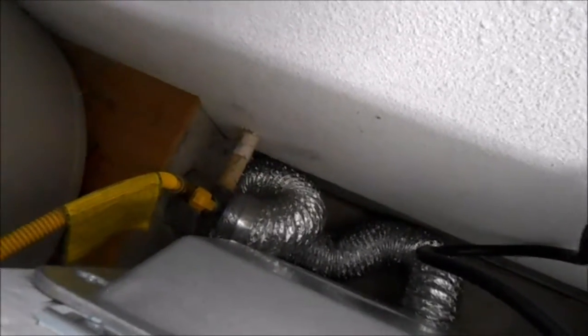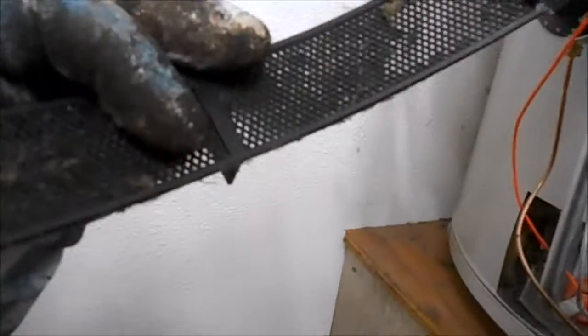We have no fire in the heater here. Quick look down here — that is an excessive vent right there, but it's not my problem. We don't smell any gas and we don't see any leaks. This one has a filter on it. These filters have to be cleaned out once a year, otherwise there's going to be problems.